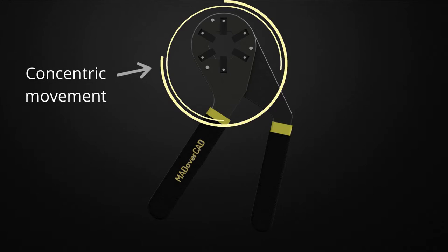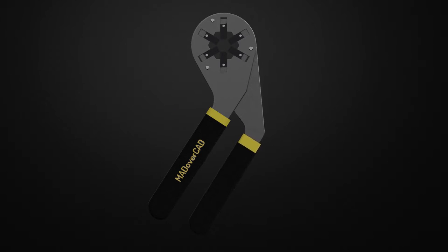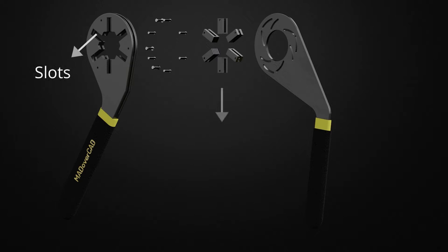The relative angular movement between the handle and the lever generates concentric linear movement of the gripping elements. The handle includes slots for reciprocating blocks which are adapted for engaging the workpiece.